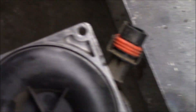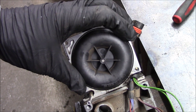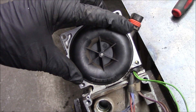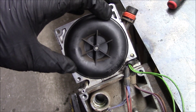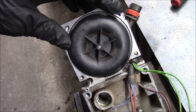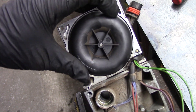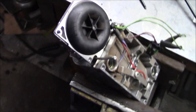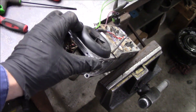I'm going to end up getting this guy a new motor. If you watch as I rotate it, the center pin - you see the movement. It's no longer centered. The bearings or whatever is underneath there is out. There's way too much runout on that little motor, and right there it gets stuck. That's a first for me. I'll have to get him a motor - this little electric motor with the fan assembly - and replace it.